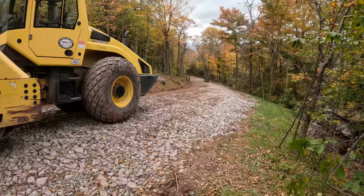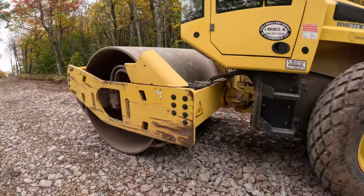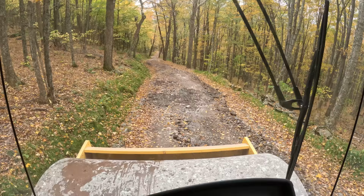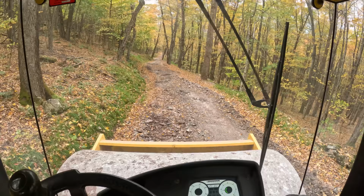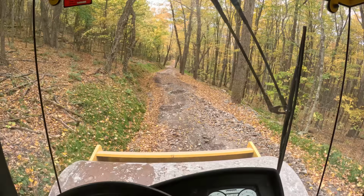Look at that, after grading it and rolling it, that is smooth. Looking up this way, very nice. This section here was pretty bumpy, and you can just see how the grader is cutting out of spots like that, and then depositing it in low spots. That's the thing, it's so long, and the blade's in the middle, it just does a really good job